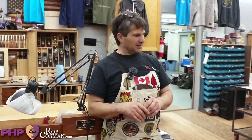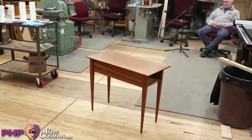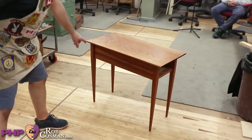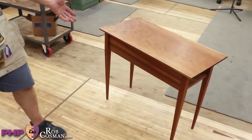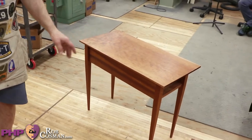Hopefully I'll find it. So I don't think there is any substitute for a mortise and tenon joint in terms of durability if it's done properly. I don't think dowels will ever come close, particularly where the joint is going to be stressed. Now, if you look at this as an example, there's a little hall table. If you had put four dowels in here, there's never going to be enough stress placed on that, unlike a chair, for it to fail.